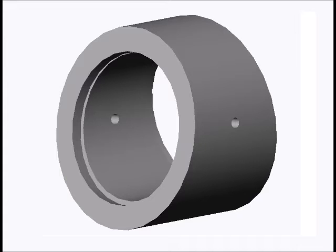If you're a great machinist and good in 3D CAD, you could make a lens holder with no adjustments, like the one shown here. I've never tried to make one like that, and if you get it wrong, you're dead in the water. There are different ways to make the lens holders, but one thing for sure: the lens holders have to be able to rotate as a group. This is because of tolerances. The lens holder fits in a ring that is pressed into the tube.